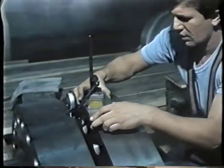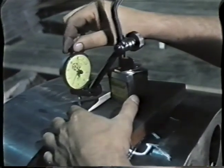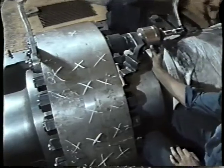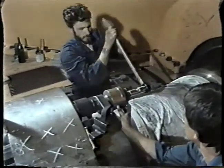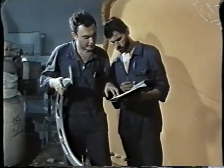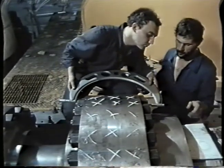Alignment of the high pressure and low pressure rotor coupling. Tightening the coupling bolts and checking bolt elongation according to set values. One last check of the elongation of the coupling bolts after final tightening.